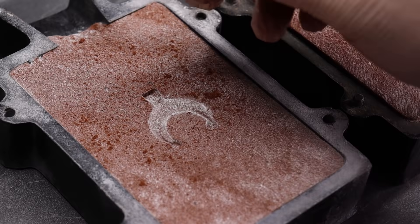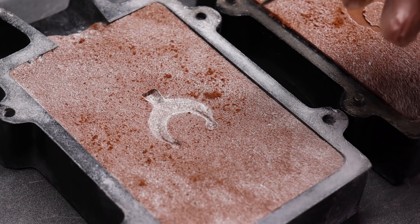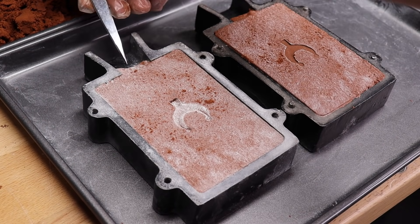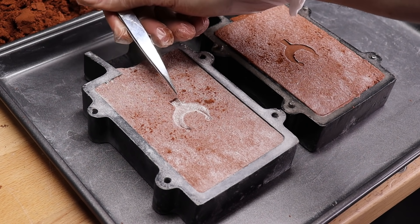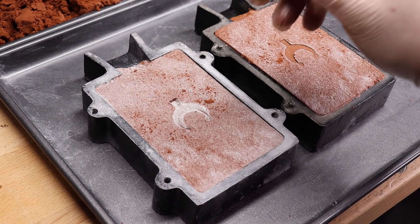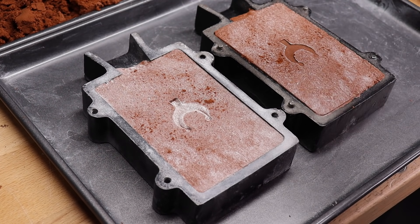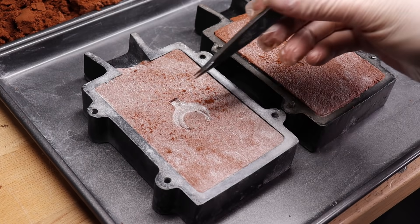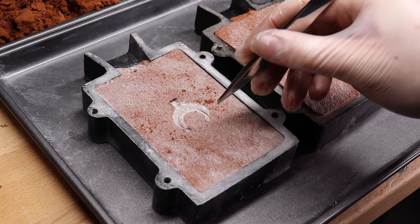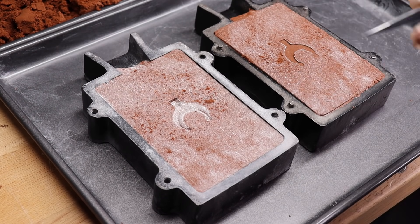These two are going to go together, and you'll see that this edge right here is a little higher than this, but all of it should just kind of fuse back together and match up. We have to make a way to pour our metal in, and you can do it a couple different ways. This flask is set up for things to come in through the top of the flask down into the cavity. Or you can do it from the sides — once I close this back up I can poke a hole through and pour it through the side. For this one I'm going to do it from the top, how you're supposed to, and for our next one I'll show you how to do it the other way.